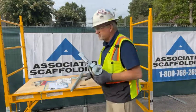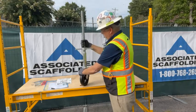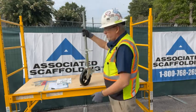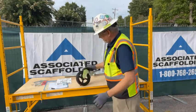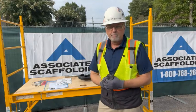Just because you're using a caster doesn't mean we can get away from the screw jacks that we talked about earlier. You can have a screw jack on top of here to level your rolling scaffold. This is a critical component — I see it often missed on job sites, construction sites, even maintenance. If you have no way of leveling the scaffold, you're in a bad situation. I'm Tim Neubauer, and that's your Safety Moment.